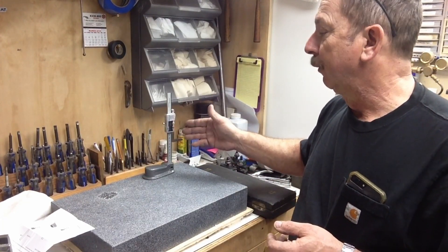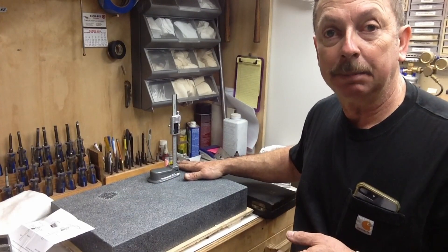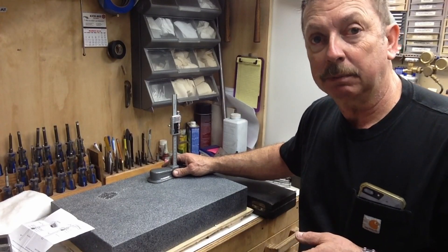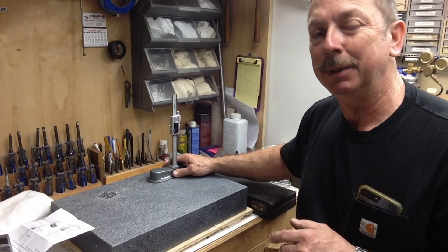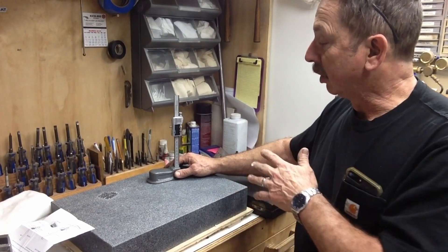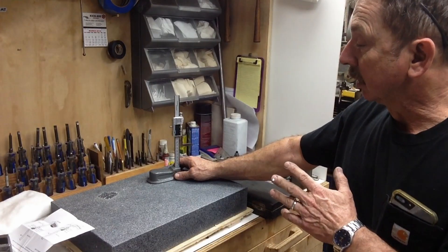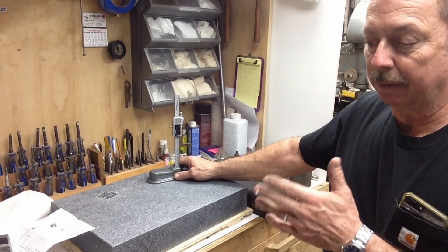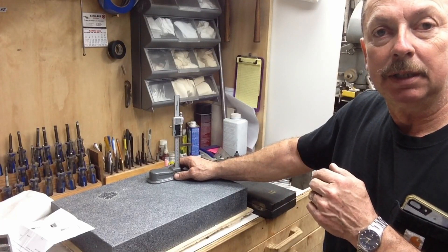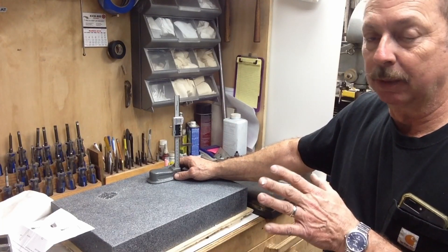The differences between them and the good ones — my preference for calipers at the bench is a Mitutoyo Digital. I used dial calipers for years and I still do, but I went to a Mitutoyo caliper and I really do like it, although the head in mine just went bad, so I'm either going to have to replace the head or replace the whole caliper. Anyway, the things that are different between the inexpensive calipers and the Mitutoyos, the Starretts, the Brown and Sharps — accuracy-wise I think they're comparable. They're reading off the scale as long as they're working properly. Repeatability on the Chinese scales is maybe not quite as good as the higher-end calipers or micrometers or height gauges, but it is very good and it's repeatable for use in the home shop. We're not doing aerospace stuff here.